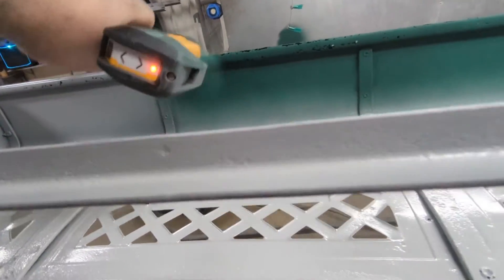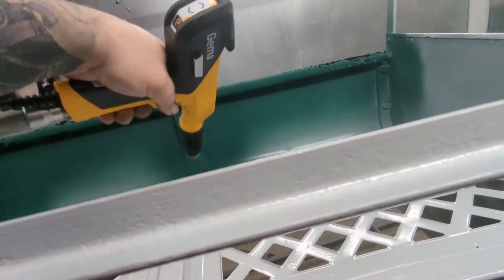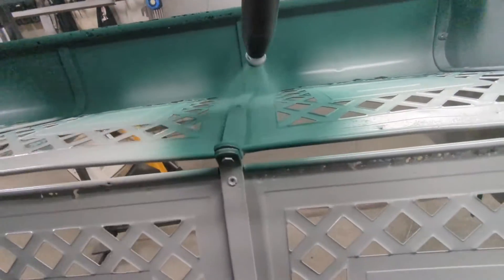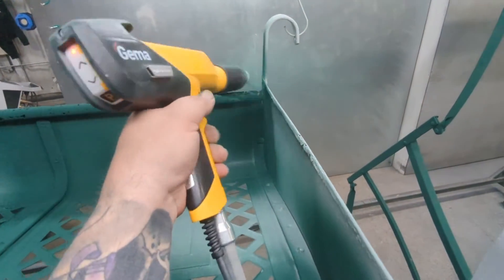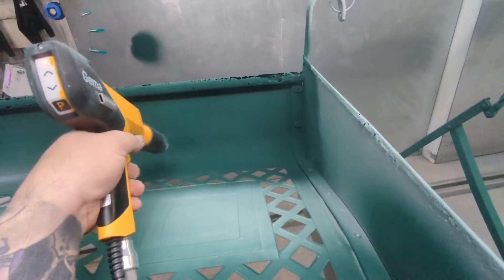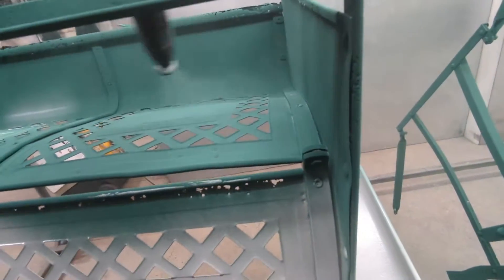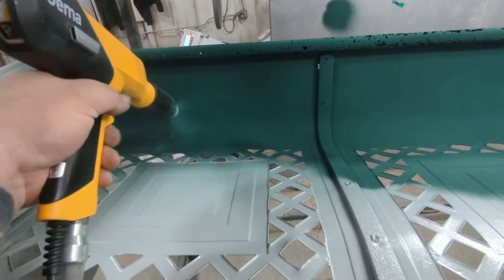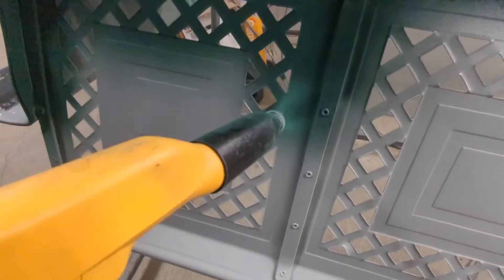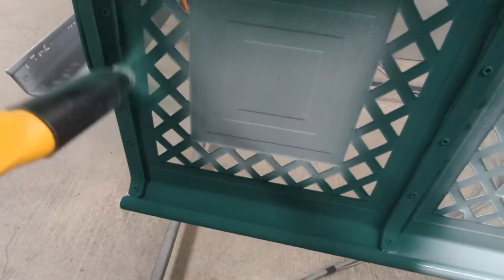This is an example of how it was hung and how difficult it is to spray. It's up about eye level with me, so I'm having to lift my arm up and over the bar without dragging the hose on it, then trying to spray across to the other side and get good coverage. There's a beam that runs across the top — the sheet metal wraps around that beam and I have to get powder up inside that, which was not fun at all. Luckily the Optiflex Pro is a champ at stuff like this. Once I dial in the settings on each job I'm shooting, pretty much no complaints from this thing ever. I'm cramming powder behind the bracket just to make sure there are no bare spots and to prevent rust in the future.